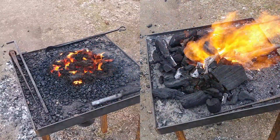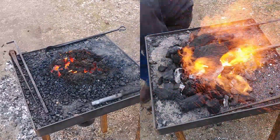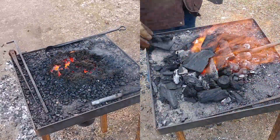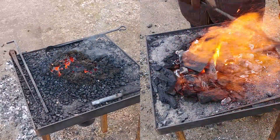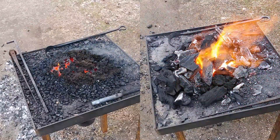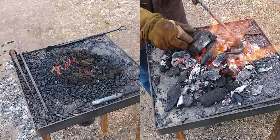With coal, not so much — occasionally you'll have an ember pop out or something like that. The other downside to using charcoal versus bituminous coal is that charcoal just doesn't last as long. So if you need to get up to forge welding temperatures, be prepared to spend quite a bit of money with charcoal to get there and keep it there for a day of welding.